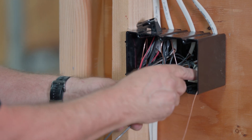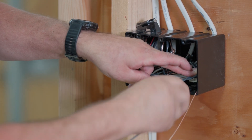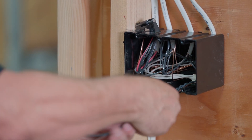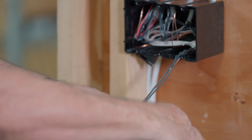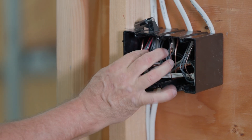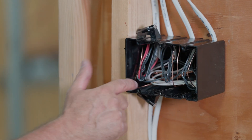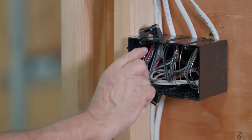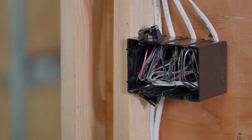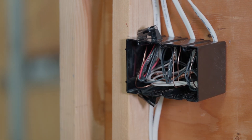On the third switch, which is also a single pole switch, twist the wires together — just a few twists to make sure they're together. Take all the conductors, cut them to length, and fold them to the back of the box. I like to roll them because when the sheet rockers come in they use a router, and if they ever go on the inside of the box the wires won't catch. If you leave the makeup sticking out there's a chance they could snip your conductor, so make sure the rockers don't come in and ruin your wires.